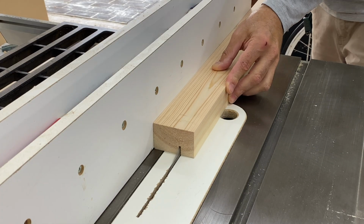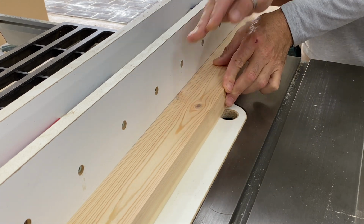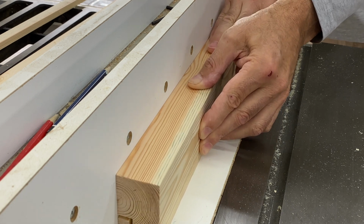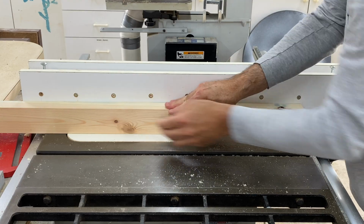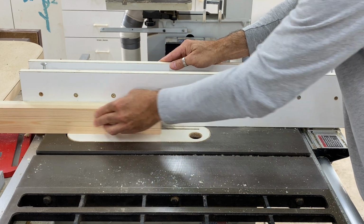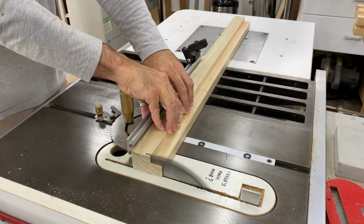The sides of the dresser were going to have an inset panel of 12mm MDF, so I cut a rebate in all the pieces for that panel to fix into. I then cross-cut the stiles and rails to their final dimensions.